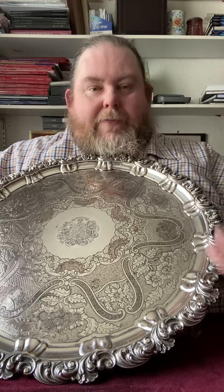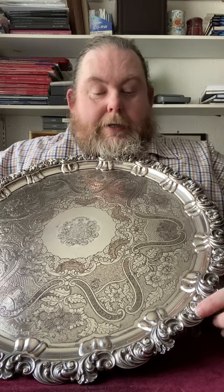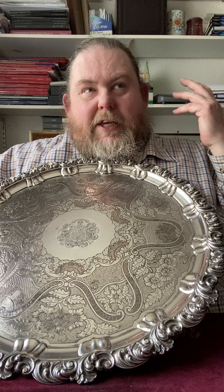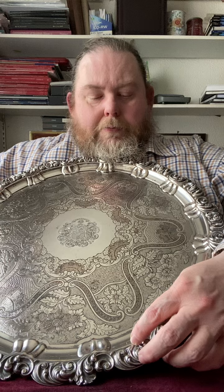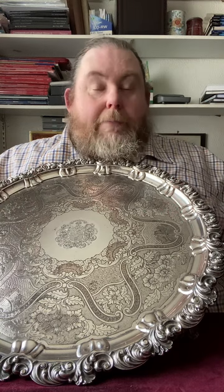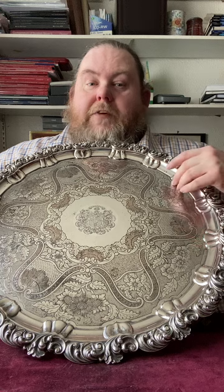But then, to give it strength, because it's very thin and it's raised up, and if you had nothing behind it, it would squash immediately, all of that is filled in with lead. So the majority of this is a lead-filled silver border, and that is what you'll find at the end of the 18th century again, and proliferating, certainly in the Regency period, when everything is much more ornate and foliate and bolder. These lead-filled borders come in, but they have a feature, and this is to cover the cut edge of this large piece of Sheffield plate.